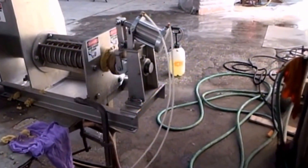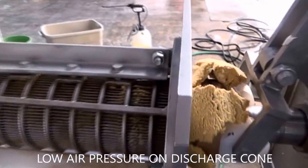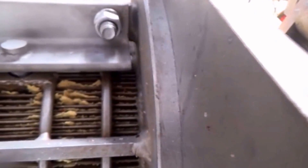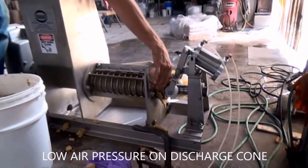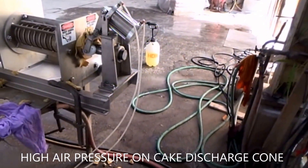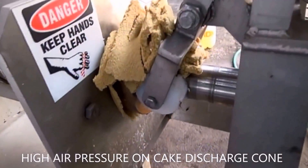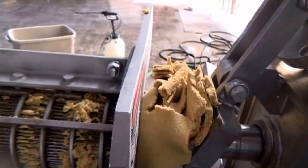I'll run the cone back in at minimum pressure. So far I've got not a drop of water coming through anywhere, but I see a ribbon of material starting to extrude through the screen. I'll increase the air pressure. We're not getting any separation of water and solids. I'm cranking up the air pressure — 40 psi, 45, there's three bars. I get a thinner ribbon coming out and more extrusion through the screen, but I'm not getting any water-solid separation.